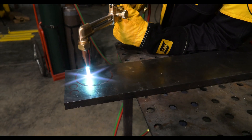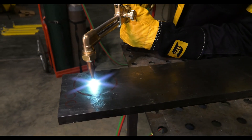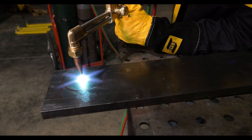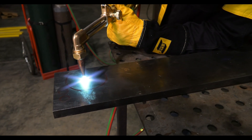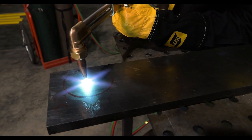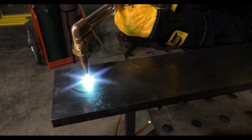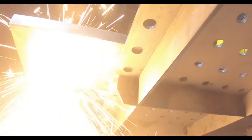When I'm piercing a half inch plate, the technique is a little bit different than that 3/8ths. I was just holding it over here, getting it to the kindling point and hit my plunger. This time I'm actually going to preheat it, get it to the kindling point. Alright, when it gets there, I'm going to lift up my torch a little bit and then come back down as I press down the oxygen. Now it's pierced through.